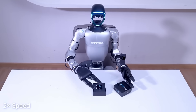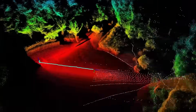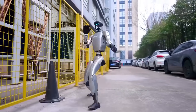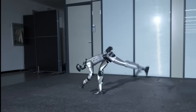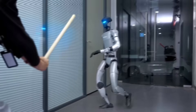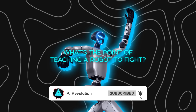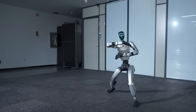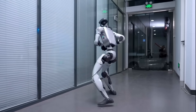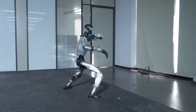Under the hood, you can feel what's happening: precise torque control in the actuators, policies shaped by reinforcement learning across thousands of motion simulations, and mocap-seeded motion primitives that map to real human biomechanics. The balance recovery, the way it redirects momentum mid-combo, the micro-corrections after each landing — that's a genuine feedback loop, the kind you used to only find on big research platforms like Atlas. G1 stands about 1.32 meters, which makes the agility even more impressive at that leverage. What's the point of teaching a robot to fight? Strip the theatrics, and you're left with a skill stack that transfers everywhere: single-leg stability for stairs and ladders, controlled torsion for tightening fasteners at weird angles, explosive but precise power for opening heavy doors, rapid slip recovery on dust or fluids, and posture discipline in tight workspaces.